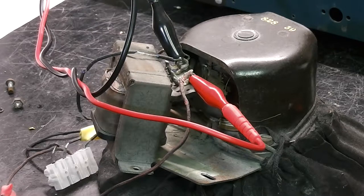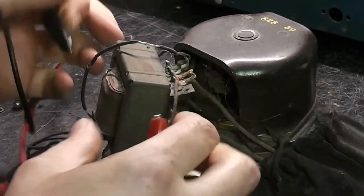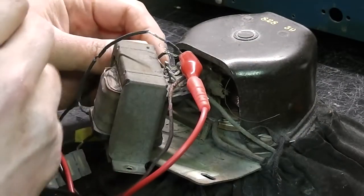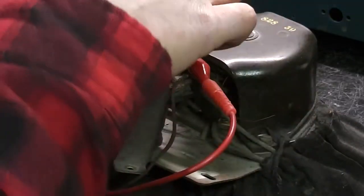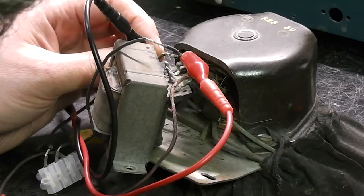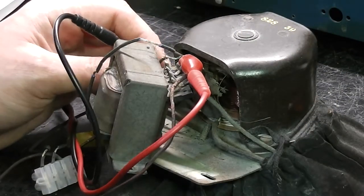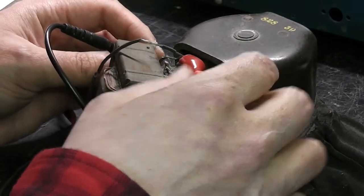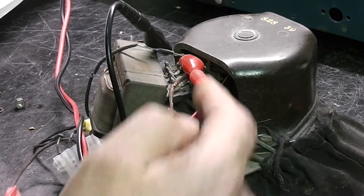L24 is listed as 1400 ohms. Testing the field coil — connecting the very delicate wire — and I'm getting no continuity on the field coil. That's bad news. I'm reading 120K. So it looks like I might have an open field coil. But given that other cable is floating around, I'm going to try and get a close-up shot of that.